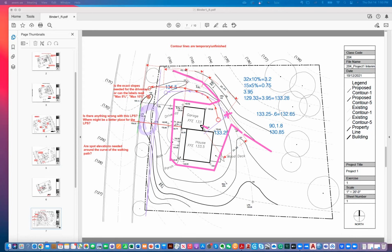So we can drag these closer, and that one can be something like this. And then, I think we'll be better in terms of this situation. Yeah, and that can be rounded. Even just at the front of the building, they run out of room so fast at the front. Yeah. But yeah, I see what you're saying. Right. In your case, with a short driveway, we have to make it very steep to be able to elevate the house to a certain elevation, and then the swale would be able to be steeper, over 2%. Yeah, I agree.